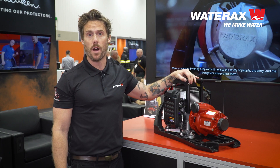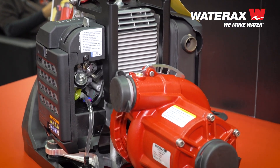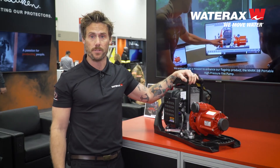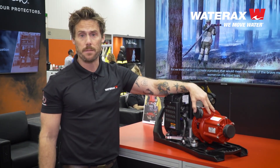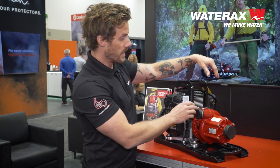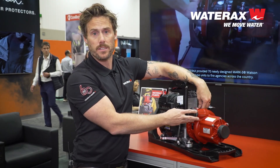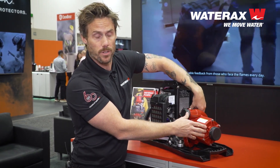The next product I'm here to speak with you about is our new Mark III Watson pump. This was seven years of R&D in the making — it's the response to an update on our 60-year-old Mark III flagship pump. This features the same specs as the original Mark III: 380 PSI, 100 gallons per minute flow. You'll see it's got a similar removable pump end, just like the B2X and BB4, so in the field you have that ease of swappability if the pump end were to go down.